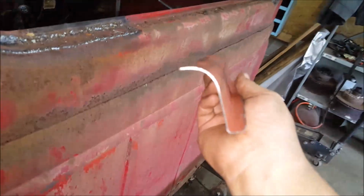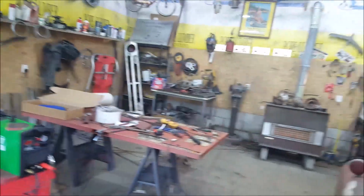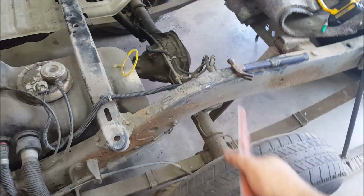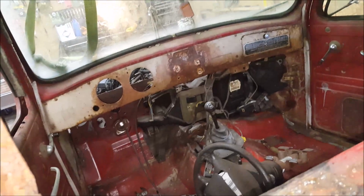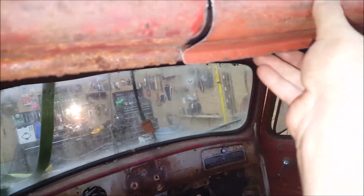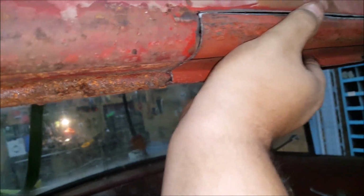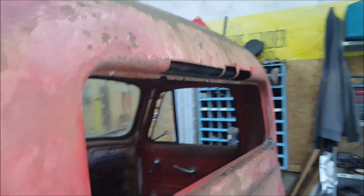Now I made this. This is all bent by either a little double piece of angle iron thing we use to bend, the vise and a hammer with the torch, and then actually I used a lot of the frame right here to get a good edge in the tire to get the round bend again. And it's relatively good to go. I mean, you can see, it's hard to do one hand here and film, but yeah, it's really close. But I'm gonna fit that in there, get that done.